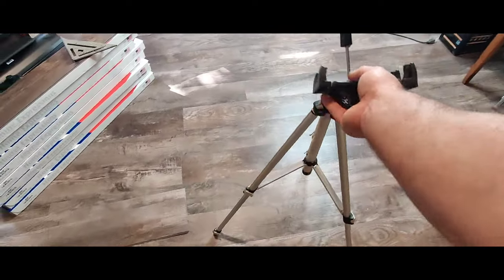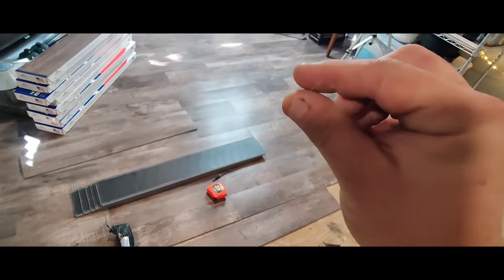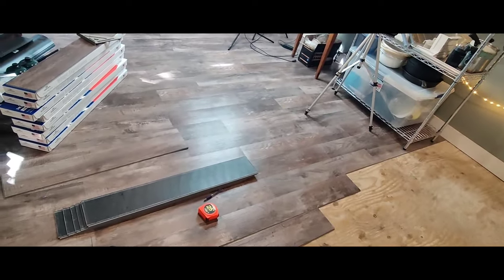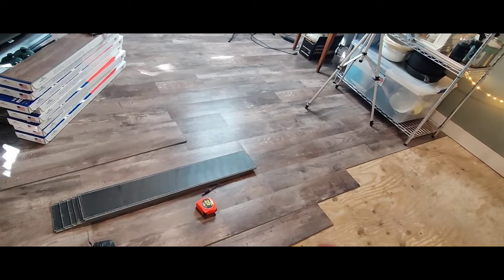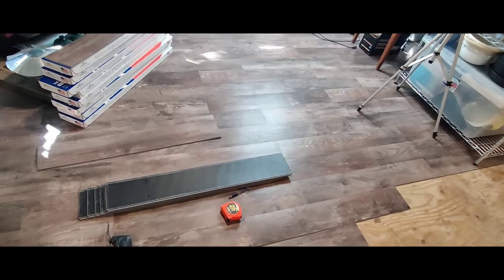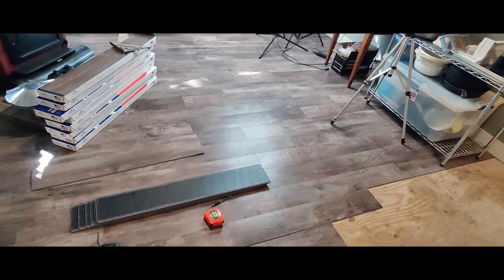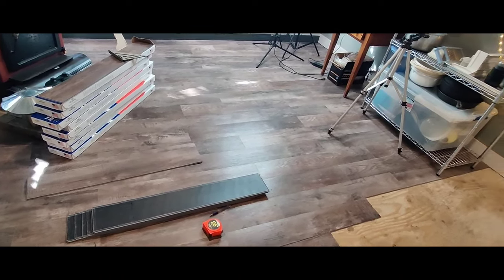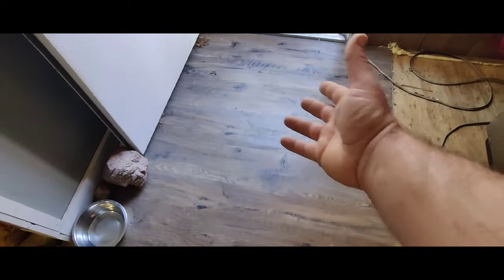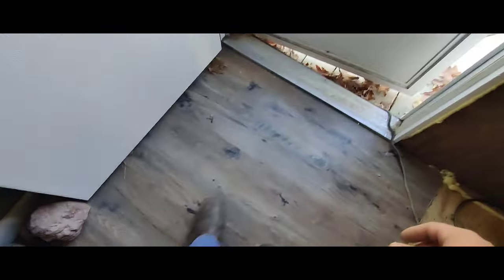So why do you want vinyl plank over regular old laminate? Laminate flooring is barely water-resistant, so if you get it wet it can still expand at the seams and end up looking ugly — it can get ruined if it gets wet. Vinyl plank is just vinyl. Water won't hurt it. And as you all know, with me always being out in the mud and getting wet and animals being wet, my floor, especially in the wintertime, is constantly wet. The little area over here by my front door is vinyl plank, and you can see it's dirty but it's not swollen at all.